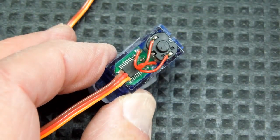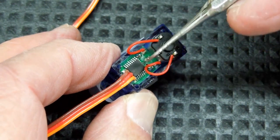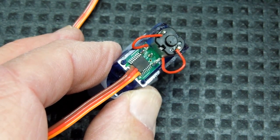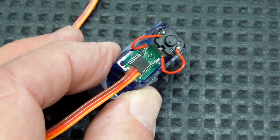When you remove the bottom cover, very gently push these wires to one side and you will see three solder connections sticking up through the board. As it turns out, the center pin is the connection to the wiper on the pot.